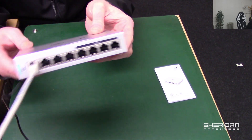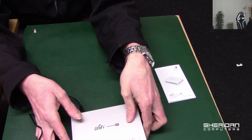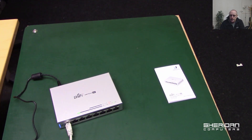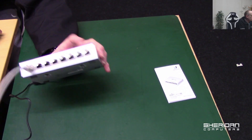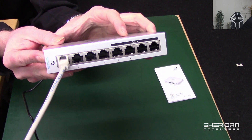The status light on the side has now gone blue — standard UniFi stuff — so we can see it's now adopted. Back in the control panel it's now changed to 'updating,' so it's downloading the update. Currently on version 3.9.549373. Now it's changed to 'update writing,' so the update has been downloaded and it's flashing the firmware. Looking at the front of the switch, it's now alternating colours, showing that the firmware is being flashed.